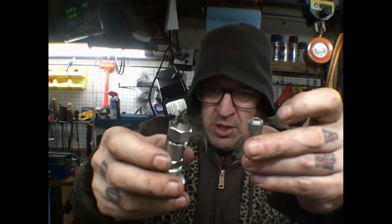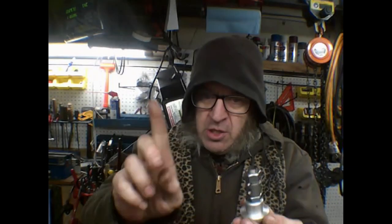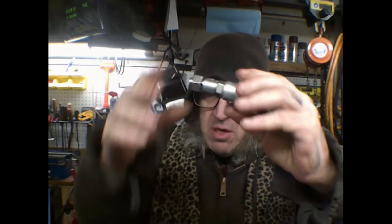This pops off - that's clearly just the air supply. I'll set that aside for now. This is what we're left with: just a body and a quick-change to handle the gravers when I finally get around to making some. This is a graver machine - it acts like a hammer, literally just makes the motion a hammer and chisel would make, repeatedly and pretty accurately. There's a lot of pulse graver information out there and those machines are simple to build, but I wanted this type to work with my existing air compressor.